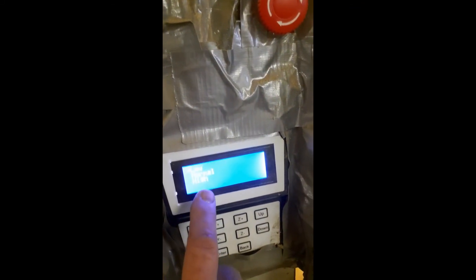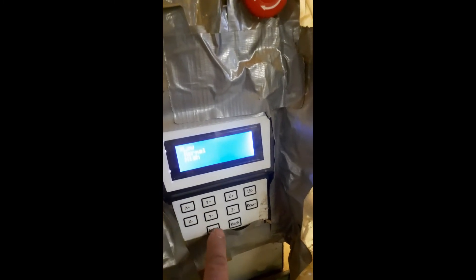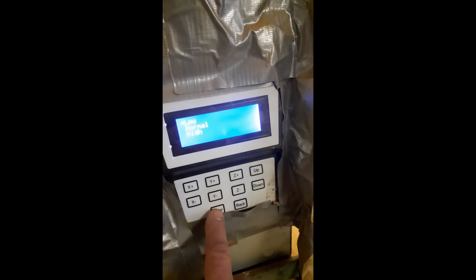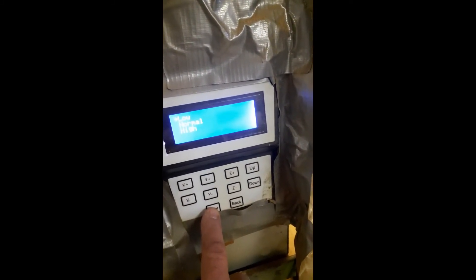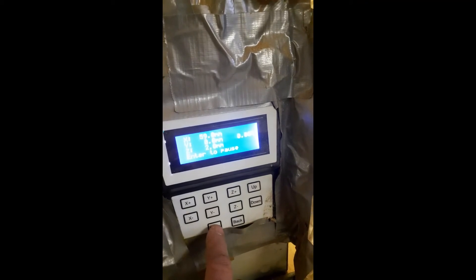This is not a high-level machine — you get three choices: low, normal, or high speed. On a proper CNC machine you can select those within the program. From experience, I know we want low, because high speed will be too hard on the horsepower spindle and that little cutter trying to cut neatly. I estimate this will be about an eight or nine hour job — it is slow. Now I've got to turn the spindle on because we're about to process.